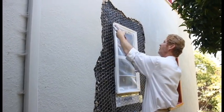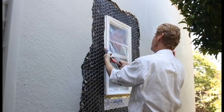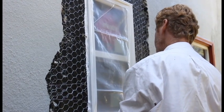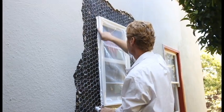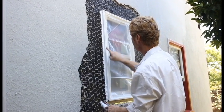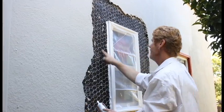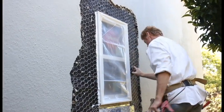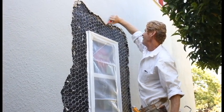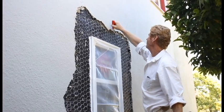Alright guys, the last thing you do when you repair this window is you caulk your seams. What I'm going to do on this particular high end is not only caulk my seams here — if you use your finger, I don't advise it. Use a brush or something, otherwise you're going to poke yourself with one of these wires. I've done it a whole bunch of times. What you're probably not seeing is there's a very fat coat of elastomeric paint on here — it's rubber. So I'm taking my knife and cutting that rubber off because it's going to interfere with my tie-in when I come back to do the stucco work.